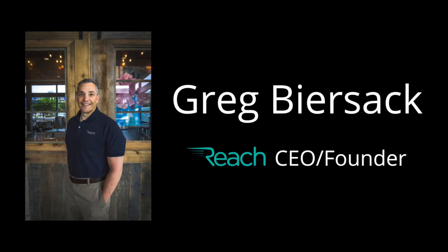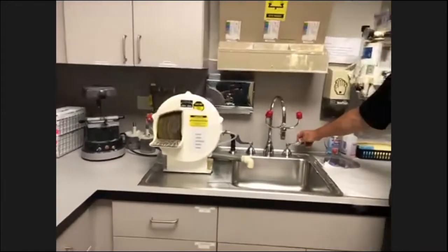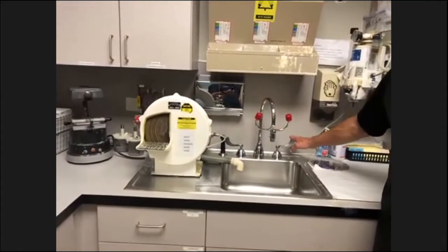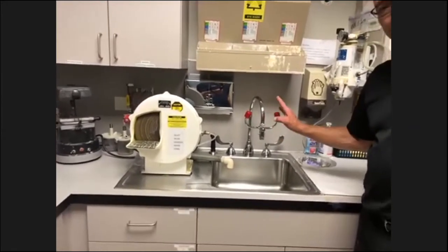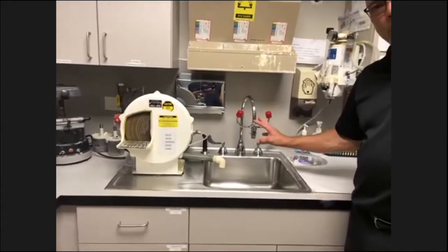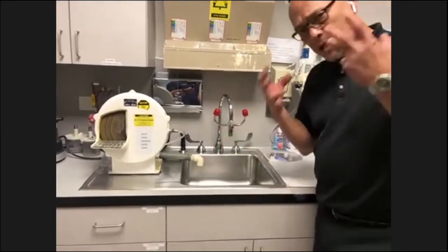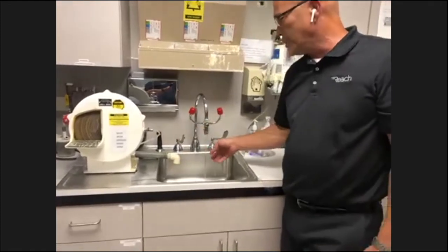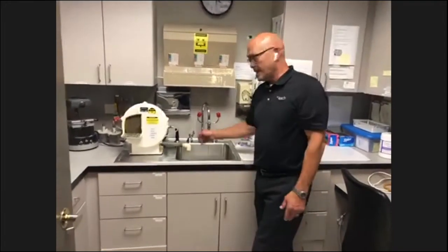Hey, Darold. Before we move on, could you share a little bit about the eyewash station there? Certainly. This particular eyewash station is manual use, meaning it's hooked up to your faucet. Wherever you install an eyewash station, you should not have any warmer water capability than 100 degrees. If someone has an eye emergency and turns on the hot water instead of the cold, a temperature higher than 100 degrees would not be a good thing.